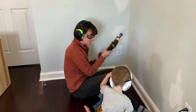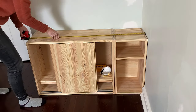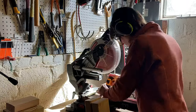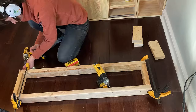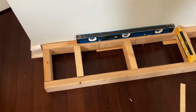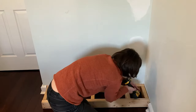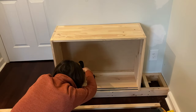First I removed a portion of the baseboard so my cabinet would sit flush in the corner. With the cabinet in place, I measured for the base — I'm making the depth of my base three-quarters of an inch shorter than the cabinet to account for the new baseboard trim I'll add later. I cut my base pieces and assembled it with three-inch screws. Nothing in my house is level or plumb, so each step required leveling and shims. With my 2x4 base level, I located the studs and attached the frame with long screws, then set my cabinet frame on the base, checked the level, and screwed through the bottom into the base.